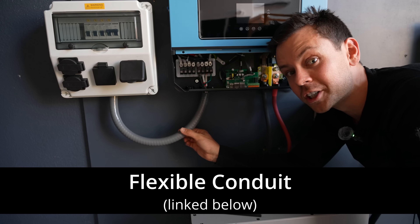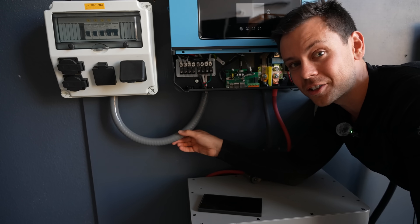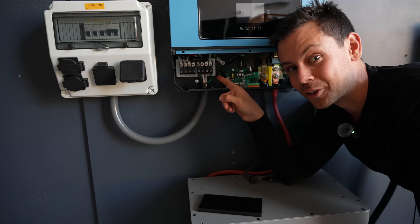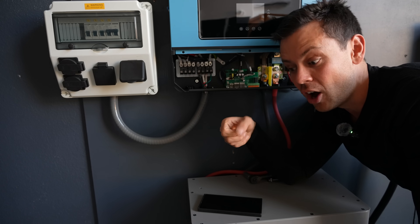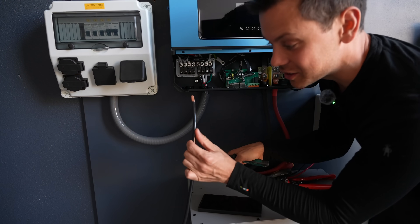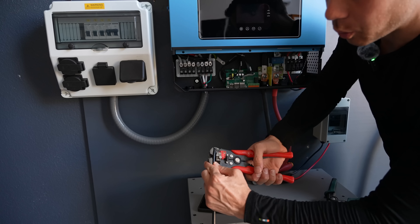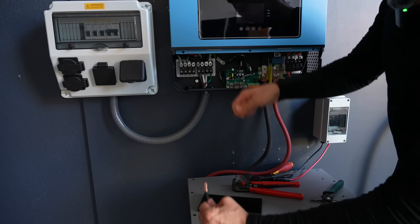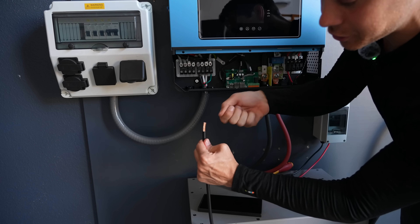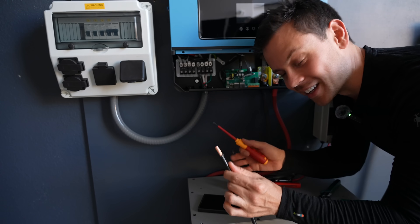You need flexible conduit to put your wires inside. It's very simple: shove the wires inside, connect them to the screw terminals, and tighten it down. To strip the wire — this is two-gauge as a demo, but it's the same process — you just cut it, use a wire stripper, shove it in the terminal, and screw it down. Just use the right size conductor.